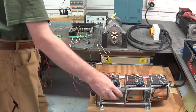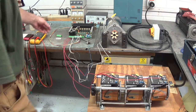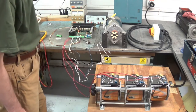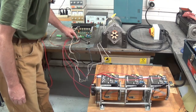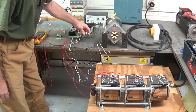I've got three phase coming into it from a Variac — that comes in on this connector right here. The motor is connected to these two terminals right here. Here's the control: the TAC comes in here, here's our speed reference with this potentiometer, and our enable switch.